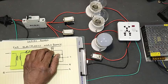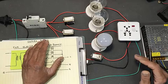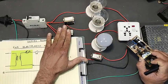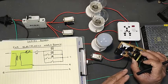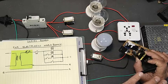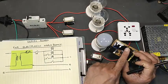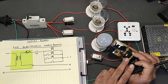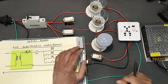When repairing boards, there are some human errors and some component failures. To cover all the repair scenarios, we must need a series lamp to limit the input current for any board. For example, if we are going to troubleshoot a power supply and we don't use a series board, a minor error can become a big disaster and damage the board. With the original fault maybe it will repair for one dollar, but due to any component failure or mistake during the repair process it can damage the board totally.